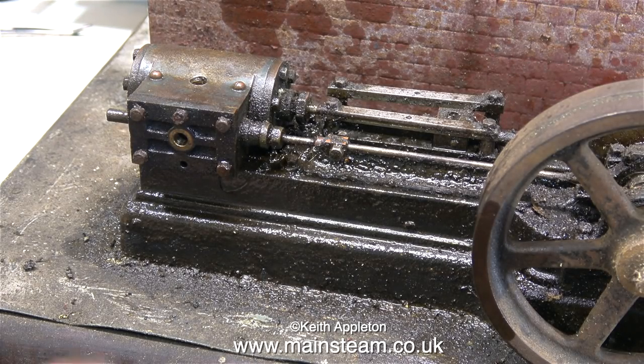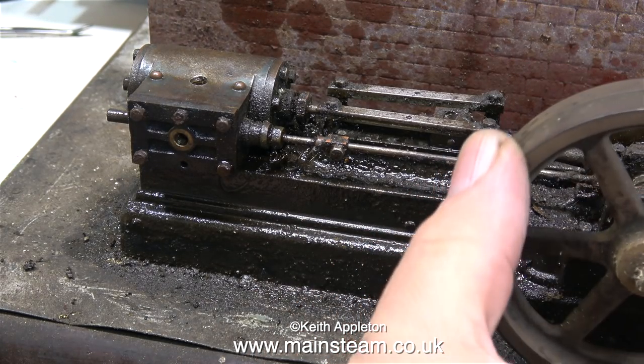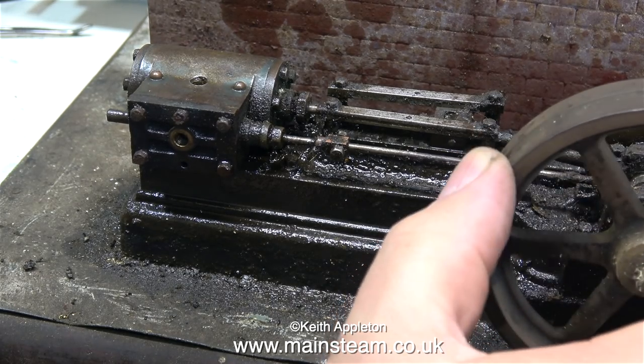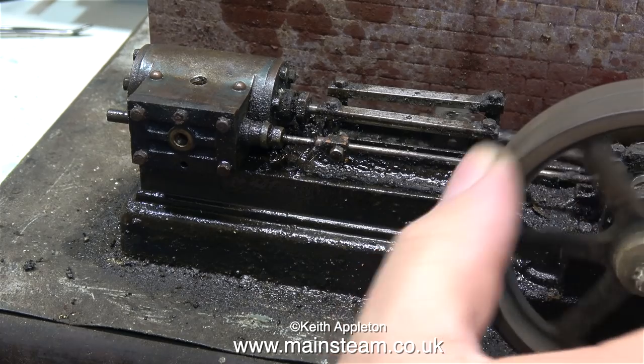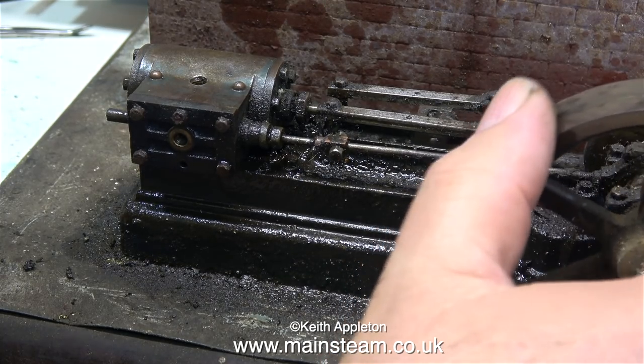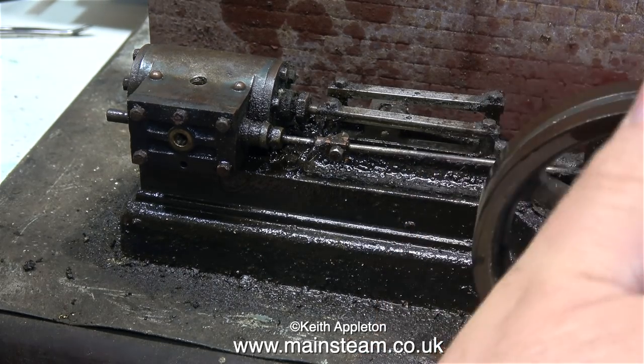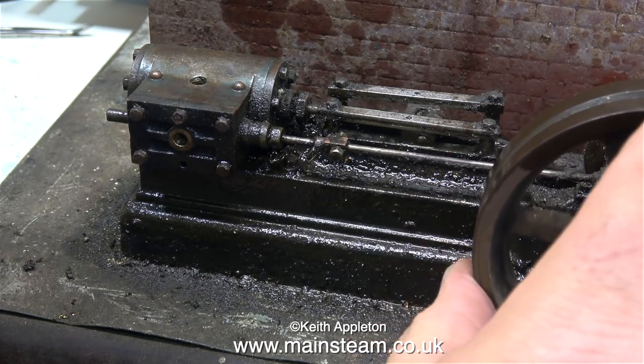I'll be very interested to find out why it doesn't work at both ends of the cylinder. I could understand it if it was at one end — that would most likely be a loose piston. But I really don't know what's happening as the piston moves towards the rear cylinder cover. It's also binding there, and it's not just tightening up — it's rock solid.